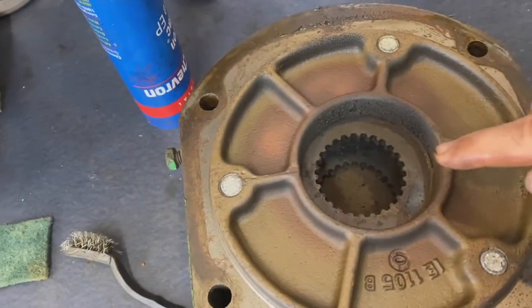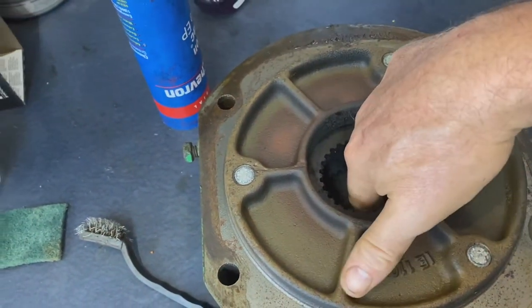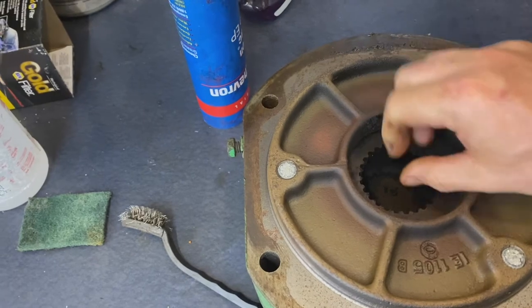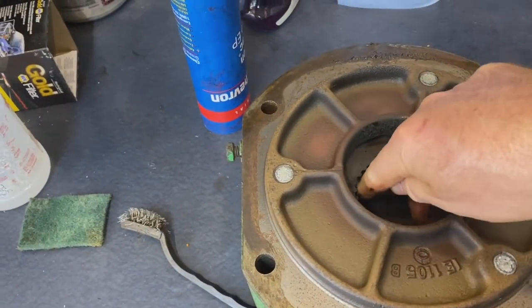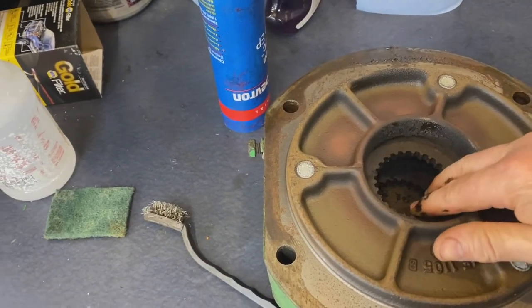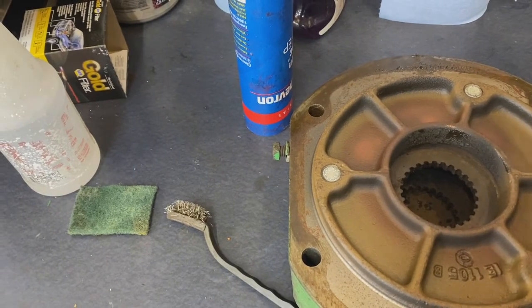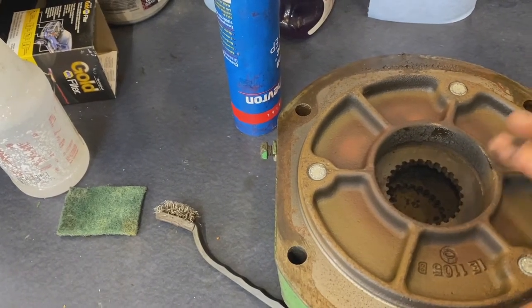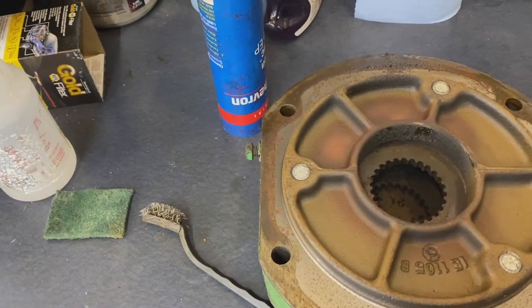Once you pull these brakes, the whole housing, these pieces in here can move. So that'll pose a little bit of a problem once we clean all this up and these move a lot easier in lining that up. So kind of keep that in mind as well. It might be easier putting this in, assembling it one piece at a time. But right now we're gonna take off these three bolts from the other side.